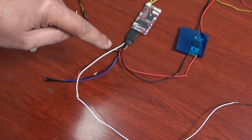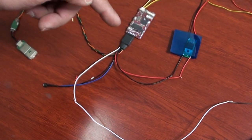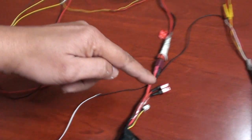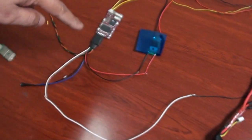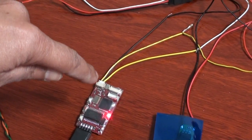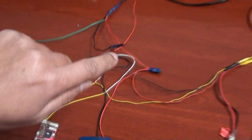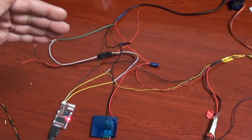This OSD also uses an audio cable to send data for the GPS for antenna tracking, and this video audio cable goes all the way to the video transmitter also. The ground here which was originally for the camera — I just leave it because my camera ground is connected in the center.